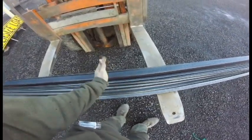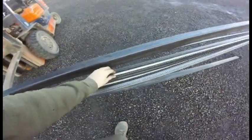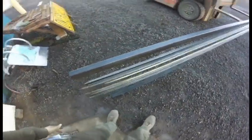These bars are gonna be 3 inches apart, vertical. And then this flat bar is going to be used as a support for the middle, going across horizontally in the middle, basically split the difference, and it'll keep these rigid, keep them from moving around too much. So this isn't like a security gate. It's pretty light tubing for that kind of thing. I mean, somebody could rip it off if they hooked a truck to it.